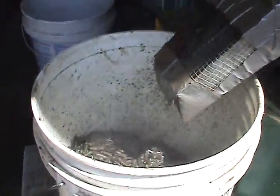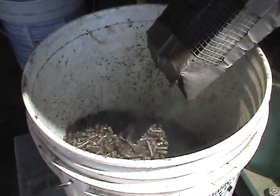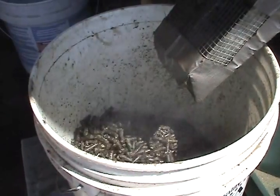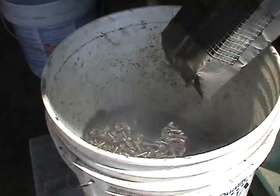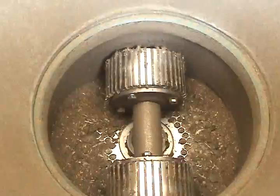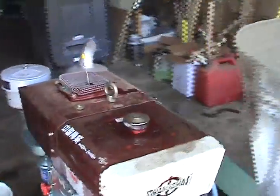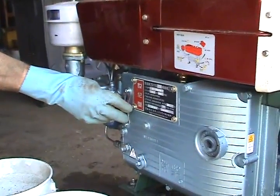Like I said, if you want these pellets to come out nice and hard, you've got to put the material in really slow. Even though this looks like it's coming out well, this is 120 pounds per hour — that's it. This is a 22 horsepower diesel engine and this is the best I can do with it. Disengage the clutch and we'll shut this baby down. I'll leave a little material in there when you stop, and then we'll take a look at the pellets we got.